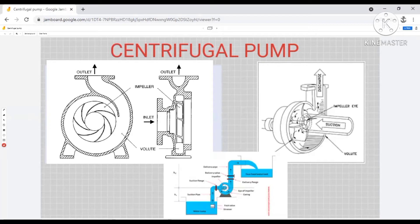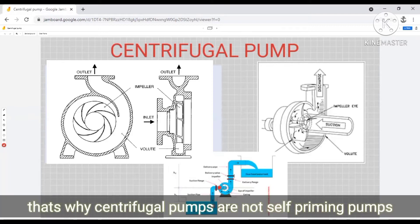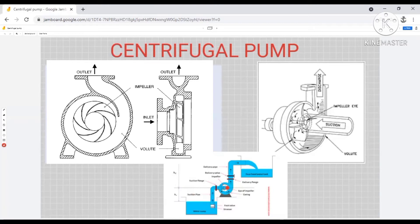So it is not the suction of the pump that draws water from the tank — it is the atmospheric pressure that pushes the water to the suction eye of the impeller. This is one of the major differences between a centrifugal pump and a positive displacement pump: the centrifugal pump doesn't have suction on its own, whereas a positive displacement pump will have suction of its own. Here, the atmospheric pressure, which is at a higher pressure than the suction pressure, pushes the water to the suction of the pump.